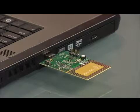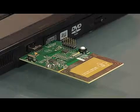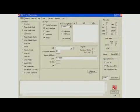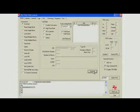When power is applied, the kit goes into a standalone polling mode. When a tag is within range of the antenna, the LED associated with the ISO protocol of the transponder will illuminate. For further tag operations such as writing and reading user tag memory, the available Windows GUI software can be used. The MSP430 firmware, along with the board design files, are also made available for rapid development.